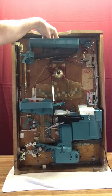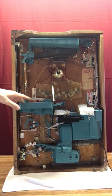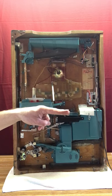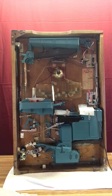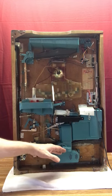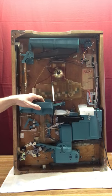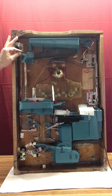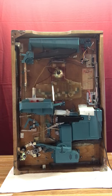The balls go into this hopper up here, they funnel down to this spot and they queue. This tray is also full of balls, and the balls continue into this chamber. If you could see in there, you would see a holder that has 14 balls. When the machine is triggered to win, it just drops and the 14 balls run out, it comes back up, and 14 more balls go back in. A losing ball goes back into the tray. With a lot of pachinko machines a losing ball exits the machine and you need a box to catch them, but in this machine — being a recycler — any losing ball goes back into the center tray. When the center tray starts getting empty, it will automatically open up and let more balls in, so it's pretty rare that you have to add balls to this kind of machine. It just keeps using them over and over again.